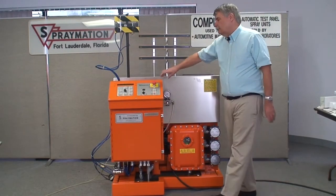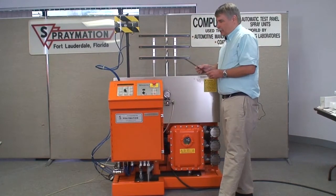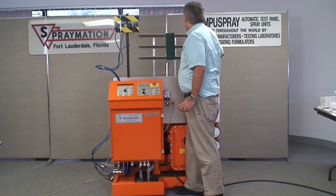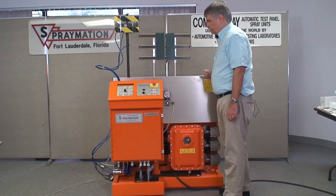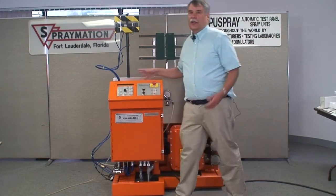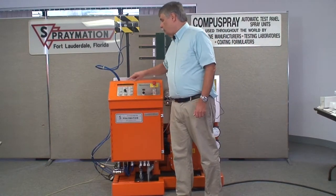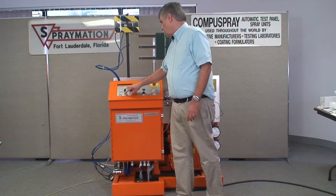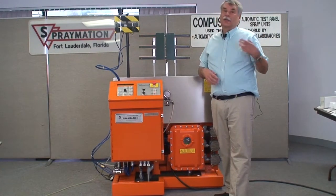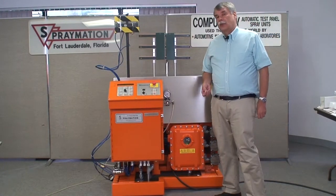When you're done with your setup or flow testing, always press emergency stop. If you're going to prepare to actually paint some panels, the machine is in emergency stop so you can put your arms or your body in this area, mount your target panels to the magna bars, and then go back and select automatic painting to paint the last script that was put into memory. There is also a recall script function, which will be detailed later in the video. The script loaded into the machine remains in memory even if you power the machine off or come back the next day, so you need to verify it is the one you want to run.